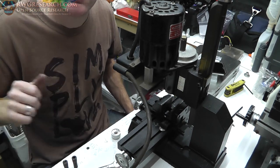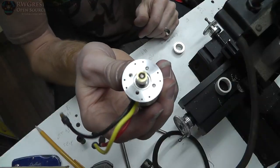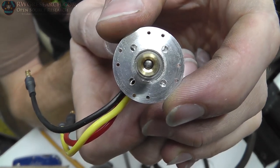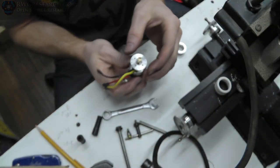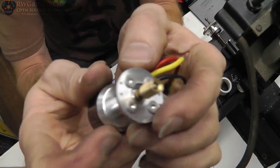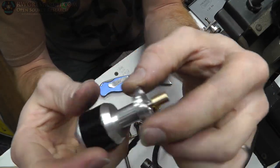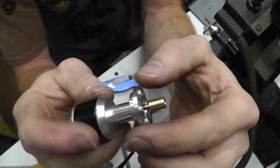Let's pop this out because I want to look at what that plate looks like. At a glance it looks like I did a really good job. Those holes are perfectly aligned — you can't even tell except for where those wires are. Those holes are exactly where they need to be. Perfect. I am going to ream them out a little bit by hand just to make sure they're in the right spot, and they are. I reamed those guys out and got that plate on there. I'm really glad I put that little extra lip on there to make sure everything's centered — that helped me a lot. Even if there's any play in those screw holes, we know it's still in the center because of that little lip.